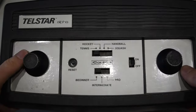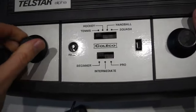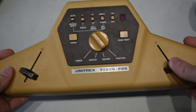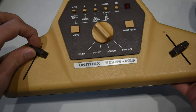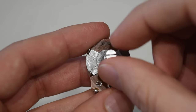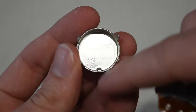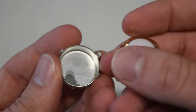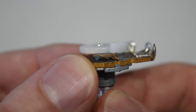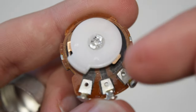First generation controls typically used a knob-based potentiometer. Rotating it in a direction only rotates so far — in games like Pong, this would move the player's paddle upwards or downwards on the screen. Another first generation console uses a slider style potentiometer instead of a knob. What's actually going on is that there are metal contacts that wipe across a resistive sheet, changing the strength of the electrical signal that makes its way from the pins as they move around the plate.